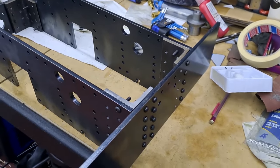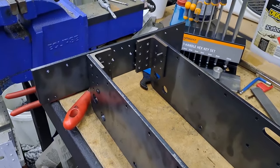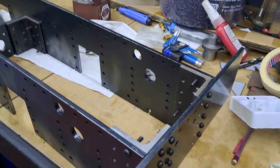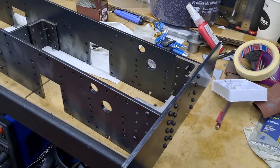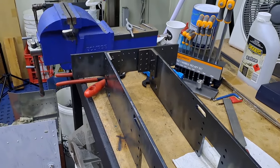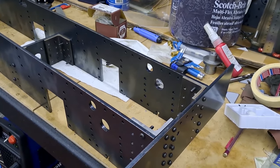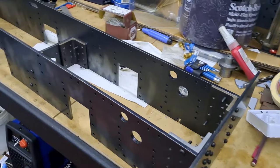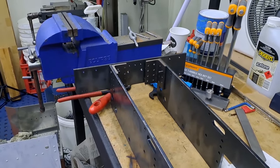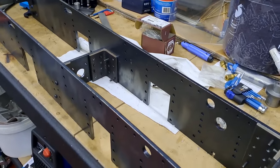Make sure everything was in the right place before you start drilling, locking down the table when needed. Now one thing I did notice — a lot of swarf was flying around. I've done a bit of slow-mo, first time ever, so this will be interesting, just so you can see how far the swarf flies when drilling a simple hole. So if you're doing this at home, whether it's your own locomotive or you're building anything, please, please, please — health and safety warning — please at least wear goggles, safety specs, whatever you want to call them, or a face mask. I reckon you should watch the slow-mo segment. We know the swarf flies, but to see it in slow motion is actually quite interesting.